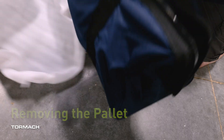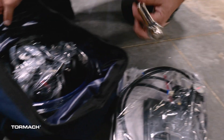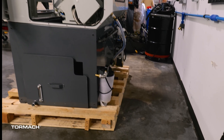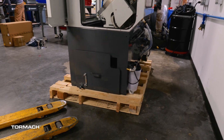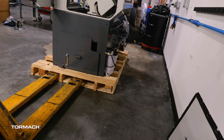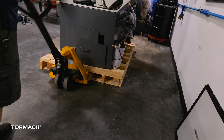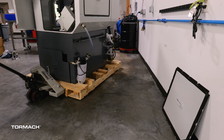Remove the pallet. Open the tool bag and remove all the items. You will first need the stand feet and legs. You will need room behind the 15LX lathe to put a jack in from behind, so you'll need to move it from the side. Don't use a narrow jack as the weight is further back. Use a standard pallet jack and lift from the side where the coolant tank slides out.